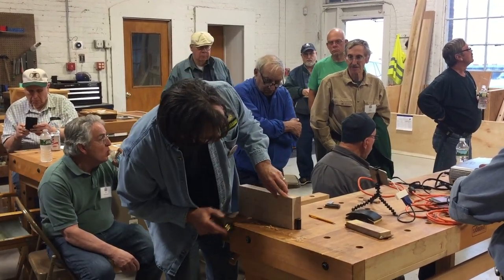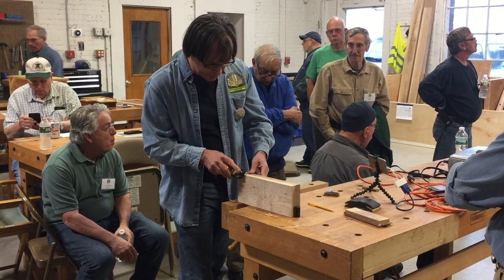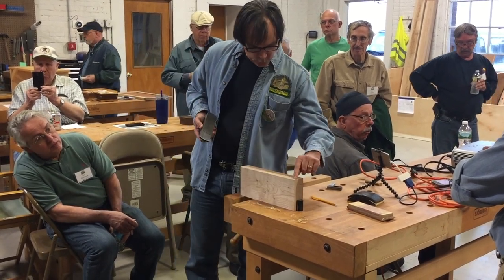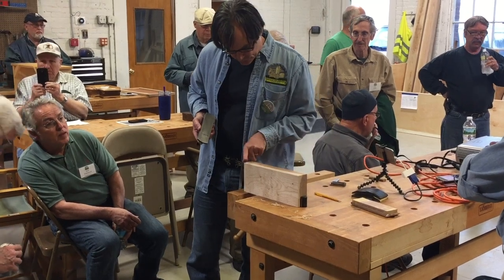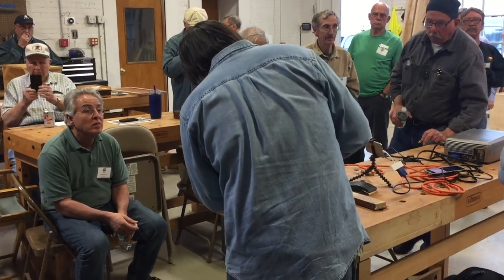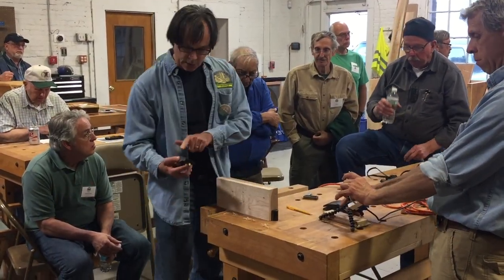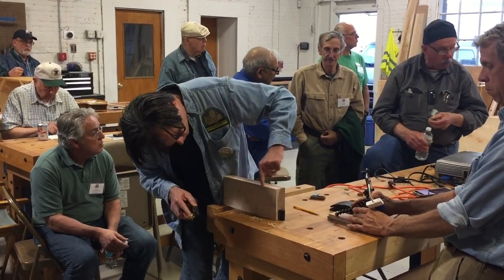I'm almost at my lines here, and things actually look pretty even. I'm going to start working towards the middle. One of the nice things about using a hand plane — this particular piece of wood is really wavy. I might want to come in from this end because the grain is rising this way, and also rising the other way. I can actually work from both ends if I really want to do a nice, smooth job. I'm almost at my lines, so I'm moving over to the right-hand side of the plane blade, and I'm just going to make a nice, even pass and make sure I'm even all the way around.